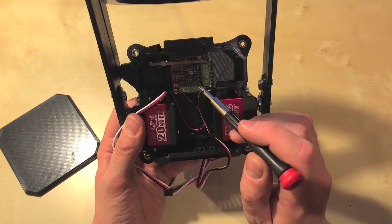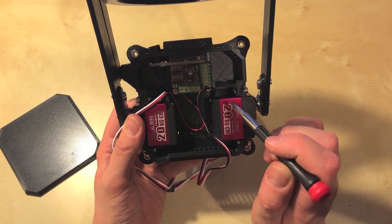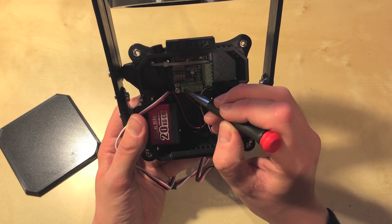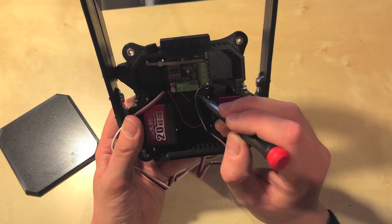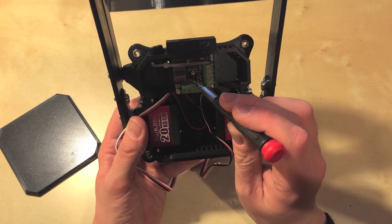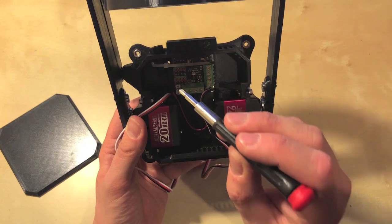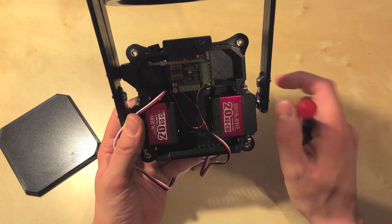The other problem is that some of you want to use quite powerful servos that are going to draw a lot of current. The issue is that the power has to come from this lead, through the terminal block, and then run through tracks in the Romeo board itself to the pin rails. Those tracks aren't particularly large, so if you put a lot of power through them they're going to heat up and you might end up burning them out.